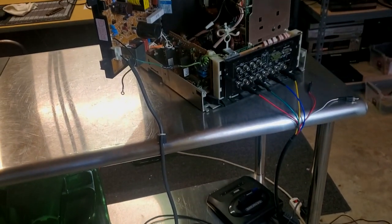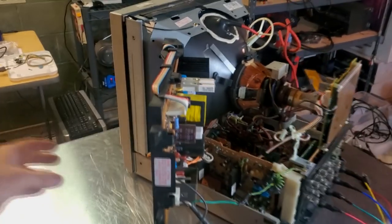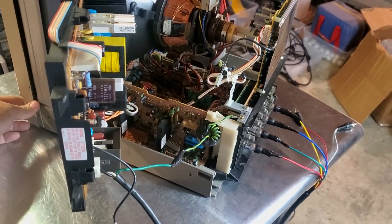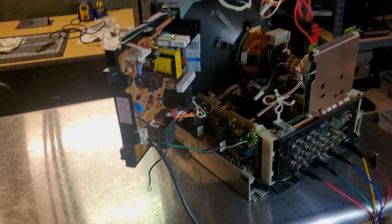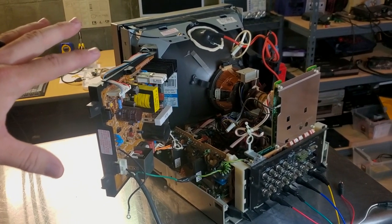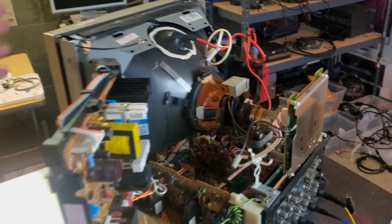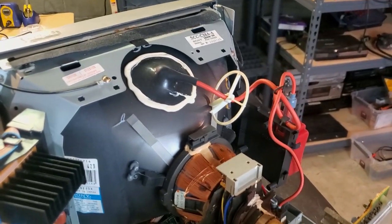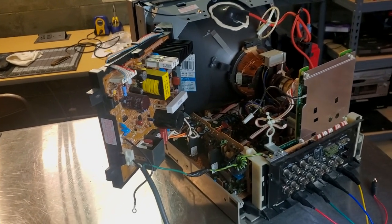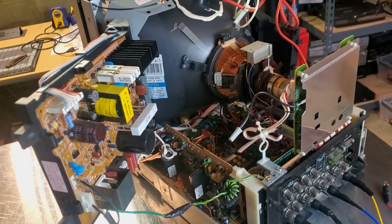The cable has been replaced. We've got a Sega Genesis hooked up to RGB — let's go ahead and for the very first time power this thing on and see what happens. It definitely sounds normal — you can hear the 15 kilohertz whine, the gong from the automatic degaussing, and you can hear those electrons starting to fire in the tube. I can feel static electricity on the tube. I'm going to give it a second before we look at it and see if anything comes up.